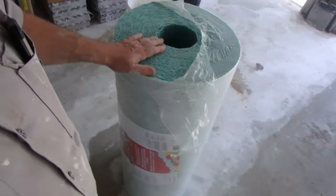I actually prefer an uncoupling membrane over a backerboard because I just think it's a better job. When you put a backerboard on the floor, you cement that backerboard to the floor and then you nail it down. So all the assembly — the plywood and the backerboard — is adhered together, and then you've got the tile bonded to the backerboard. All the movement in the plywood will transfer all the way through to the tile. Whereas when you use an uncoupling membrane, the tile and the floor underneath are actually uncoupled.